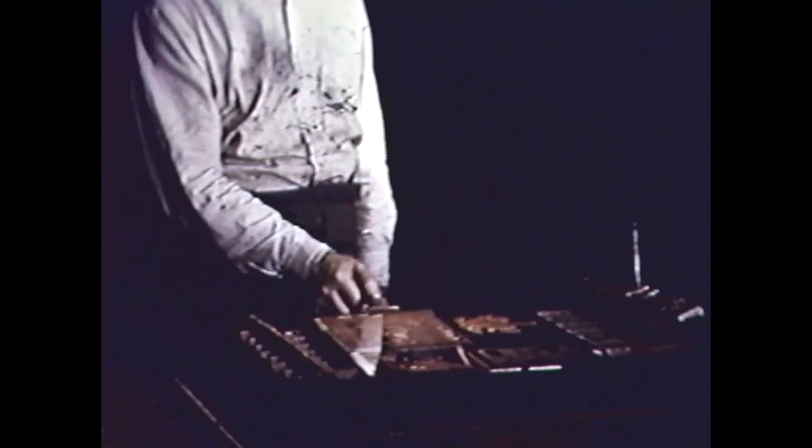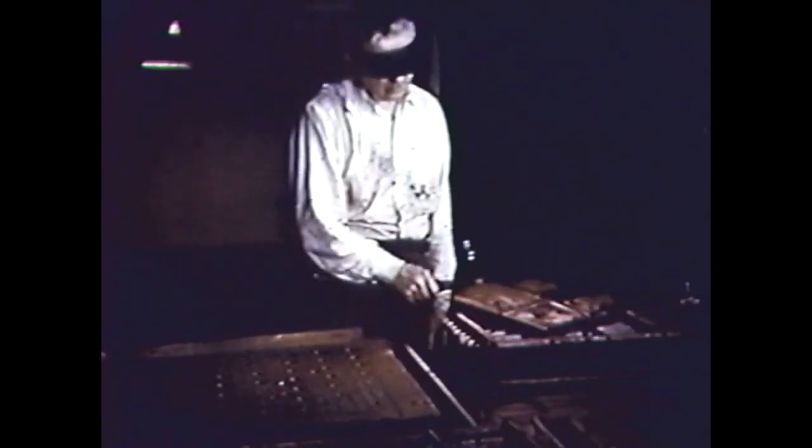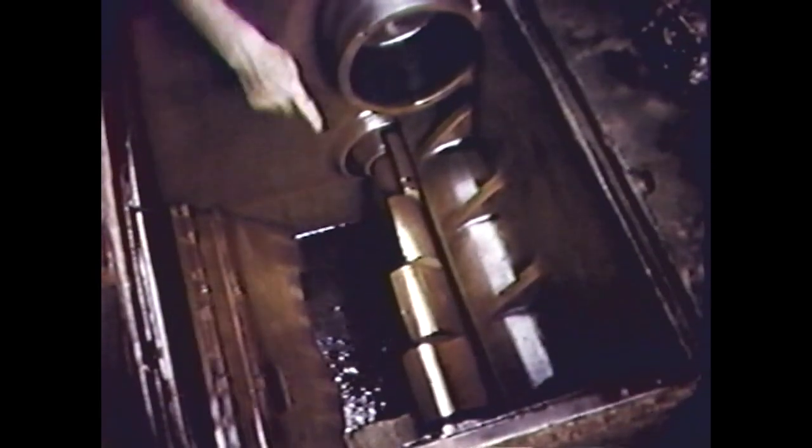But this is only the beginning of the etching process. The plate is now brushed with an acid-resistant powder, picturesquely named Dragon's Blood. This powder is brushed on in four directions, one direction at a time, with expensive camel's hair brushes. When this Dragon's Blood is heated, it melts and the resin forms a protective coating on the sides of the dots. The Dragon's Blood must be burned in after every powdering. The unprotected valleys of the dots are subsequently etched by the acid, creating the necessary printing depth that will keep the bottom of the plate from printing up on the paper. The plate is rapidly cooled and now it is ready for the acid bath. Notice the paddles which will splash or agitate the acid against the plate. The second bite clearly shows the effect of the acid. The valleys are deeper and the protective dots stand out in relief.